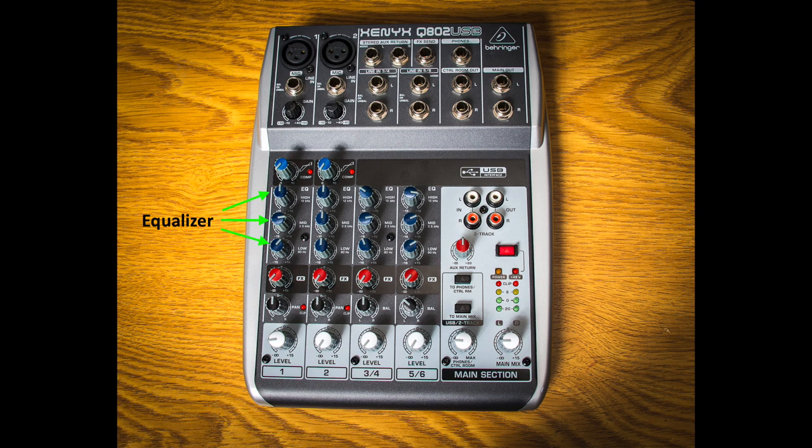You'll also find that you've got a lot of highs maybe coming from static and crashes and so on — you can sometimes roll those off and get a much more pleasant-sounding signal. If you've got a signal that's got some muddy lows in it, which are making the sound a little bit indistinct, you can roll the lows back off and boost the mids. By playing around with the three-band equalizer, you can actually make quite a difference to the fidelity of the audio signal.